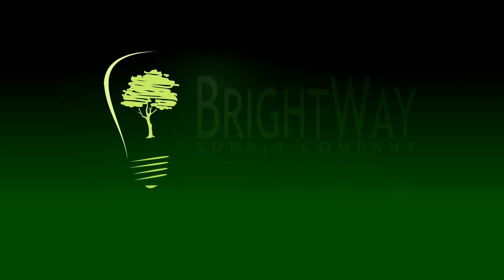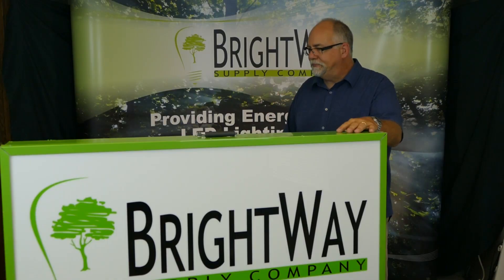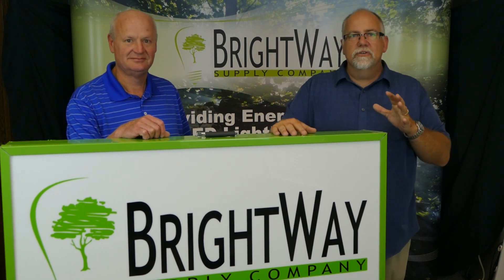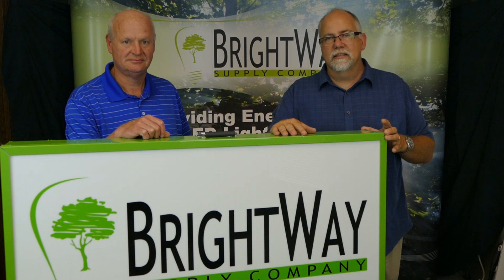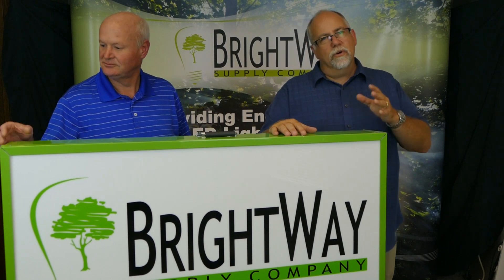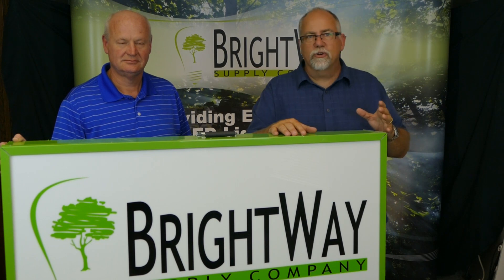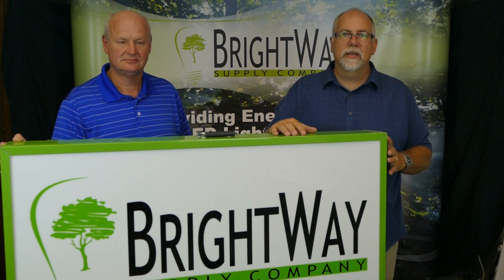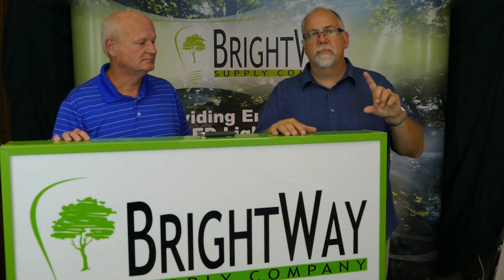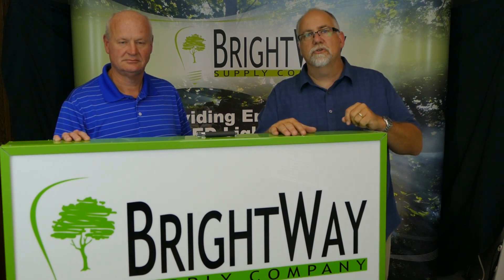Bob, it's good to see you. Hey Marty! I love a good LED shootout. What we're going to be using for our testing is this two by four foot sign — it's six inches deep with our Brightway logo on the Lexan face. We're going to be setting up all of our competitors in two different configurations: first, three rows with 8-inch spacing between rows, 21 modules total; second, two rows spaced 12 inches apart. We'll inspect all the results visually and with a digital lux meter.